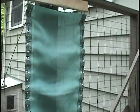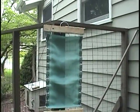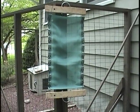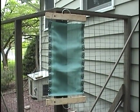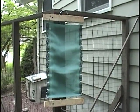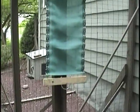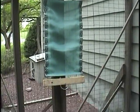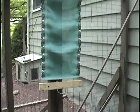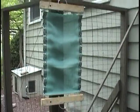This is my sling that I use for taking the bundles up. I made it out of an old piece of outdoor furniture webbing, just weaved a couple of aircraft cables through the sides, and put some U-bolts on the end. That makes it easy to put it around the shingles and latch the end of the hoist to pull the shingles up.